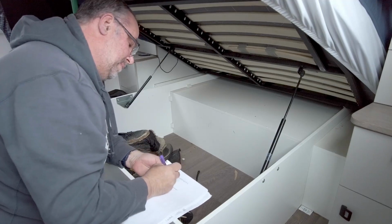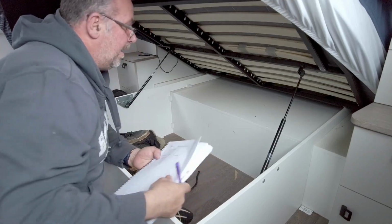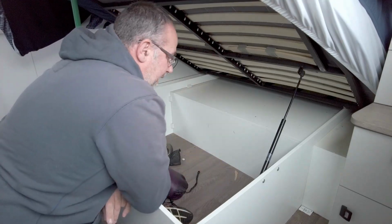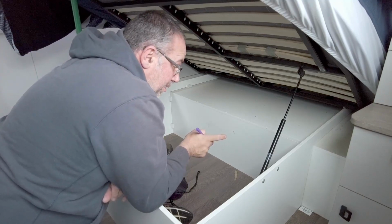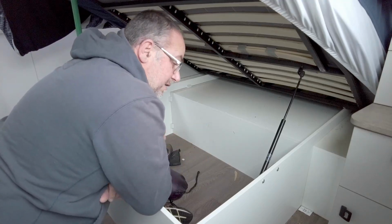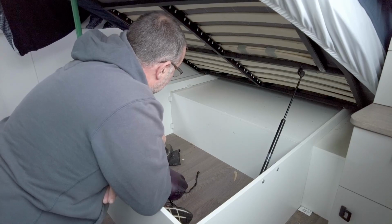So by 380, and obviously the wooden strip length is going to be 380, and that's going to be to mount it to, which I'm just going to run a wooden strip at each end. I will bond the wooden strips to the current wall that's there and screw with three screws, and then two screws will go into it onto the board at each end, so there'll be four screws holding it on, and that should be enough. Should be no need for any more than that. Okay, let's get the wood cut.